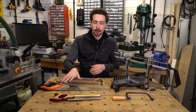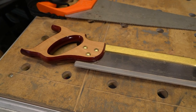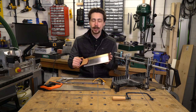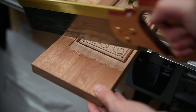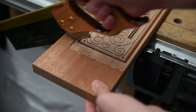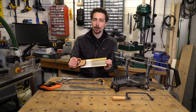One of the saws that has superseded the hand saw in a lot of my woodwork is a tenon saw. These are basically accurate saws for use in joinery. This one's made by Footprint — really well made, very hefty, has good balance, and has nice resharpenable blades. It's worth investing in a good quality saw because even good quality ones aren't all that expensive, and having that reliable cutting edge makes a big difference. More expensive ones tend to have either serviceable blades or blades that are properly hardened and tempered more evenly.